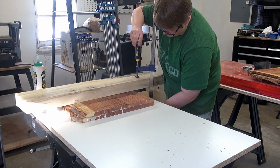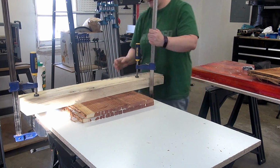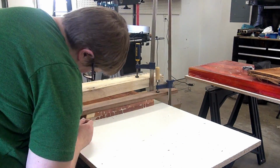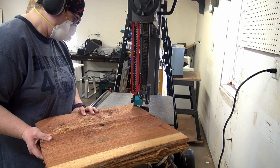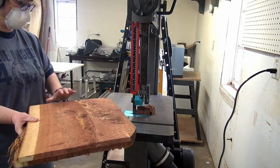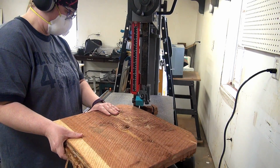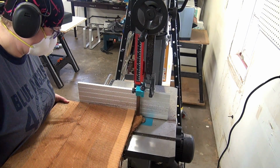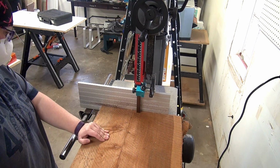All right, so you watch me break down the cedar. It's roughly 16 inches wide by 18 inches deep. That's what I was going for, but it's not exact. Each one of these is unique of its own, but that's the general outline I was going with. And then gluing up two pieces together, because this cedar was only 3/4 of an inch thick, and since I'm carving out the seats, I need more material than that to work with. So I glued it up, prepping it for glue.